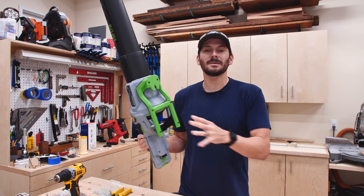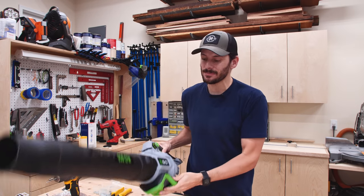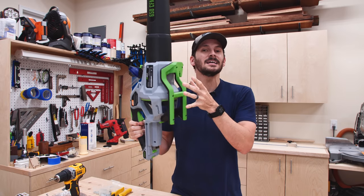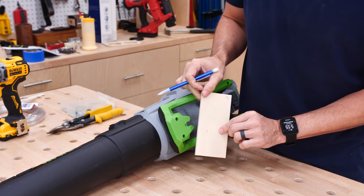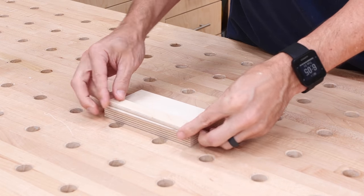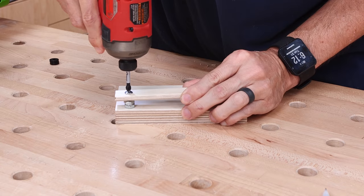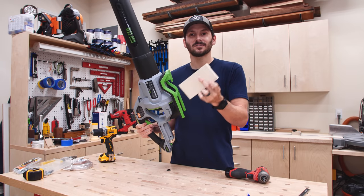My blower won't really fit any of those different mounting methods, but it has a hook on the back that you can put on the wall. I'll show you a quick DIY method for anything you can hang — I'm just going to use quarter inch plywood, cut it down, and use washers to space it off the wall the same amount as the bracket. Then just cut that piece down, put a backer cut to the same size, drill some holes, and put in the right amount of spacers to fit the bracket on the back of the blower. It looks like two quarter inch nuts will work out just the right amount. Now let's see if it fits — and it does, perfect. I made this a bit longer so that the whole base down here could engage with it, so as it rests against the wall it rests on the wood instead of wanting to put torque on the top of that bracket.